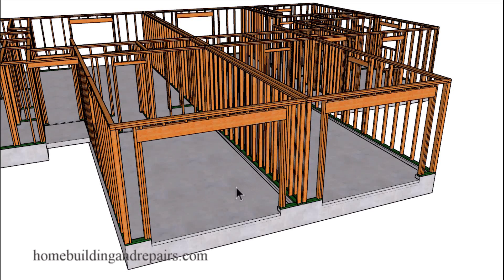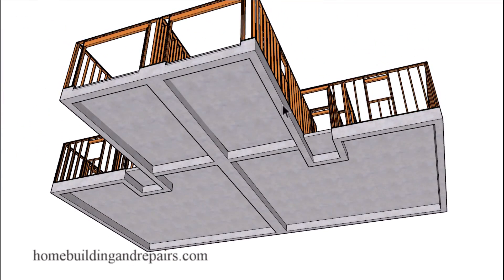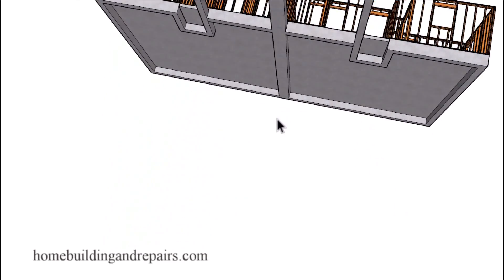In this video we will be taking a tour of our duplex apartment building. Each one of the duplexes will have the same building layout along with a solid or monolithic foundation that will connect together. I have 12 inch by 12 inch wide footings going around, a 5 inch thick floor slab, and even though the center footing is a little larger, I don't really know if it would need to be larger.